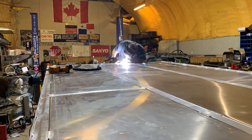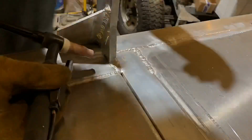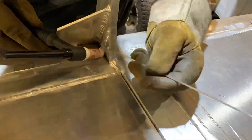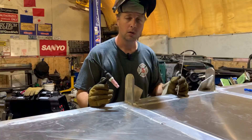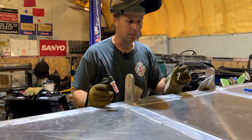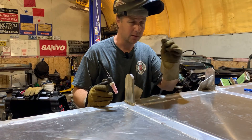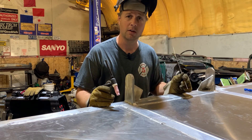The reality is that I won't actually be able to get all the way into the corner — there just isn't room. If I was MIG welding, it would be much easier. Now that I've got these two mounting lugs fully welded, all I have left to do is go across the seam on the back between the pan and the box tube. I've got to do the same thing on the front, and then there's a couple spots with the mounting lugs on the front that I've got to hit.